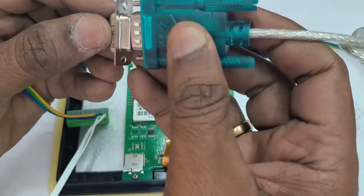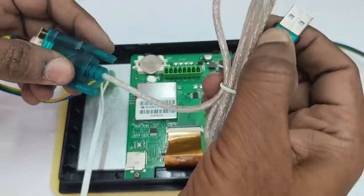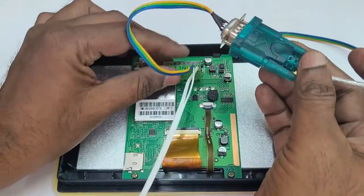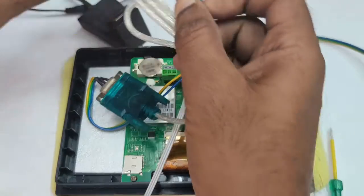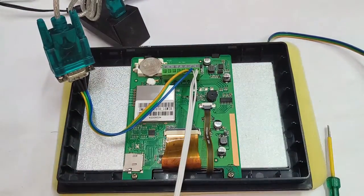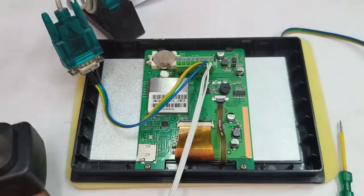For the other end we will be using an RS232-to-USB cable. This is built on the CH340 chip. We need to install the CH340 driver on the PC so that when the USB cable is plugged into the PC a COM port is offered. Using this port we will be debugging from the DWIN software. Now let us see the DWIN software.